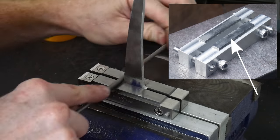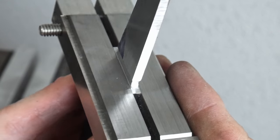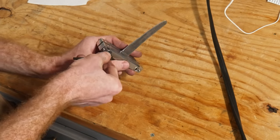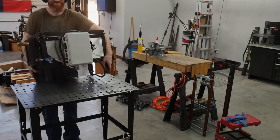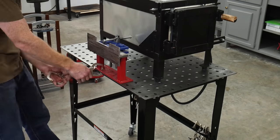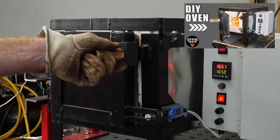On the topic of my original DIY file guide — it will work fine for future makers, but the hardest part is getting the carbide flat and in line with each other. If you have a surface grinder that can grind carbide, that would be a good solution — make the file guide, put it on the surface grinder, and ensure the carbide is flat. Also, affixing the carbide without any recess is a fairly weak design; if you're using the file guide with a grinder you could knock those carbide faces off. Make sure you recess the carbide into your file guide.